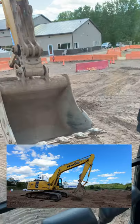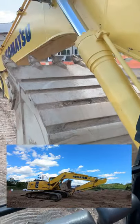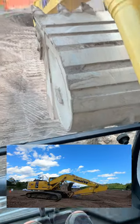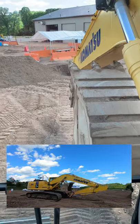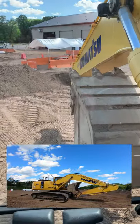...I'm trying to do this one-handed — curl that bucket all the way in and tuck it like that. You can see down low, my joints right there. This is a good travel position too, especially for overhead obstructions — you're kind of tucked in really low.